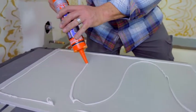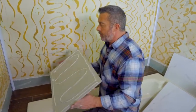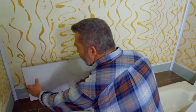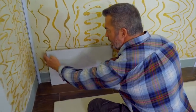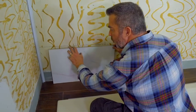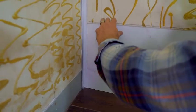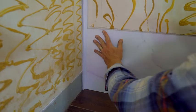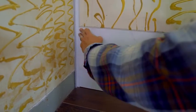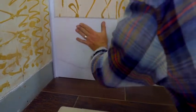Then go back and fill in the middle with an M pattern. Now that I've got the glue applied to the back of my tile, I'm going to set it in place. The first one we're going to work right into our corner — remember we have the bottom flange and side flange trimmed off so this should fit right into our inside corner track. Maintaining our level line on top, press firmly with even pressure all across the tile to adhere it to the wall.